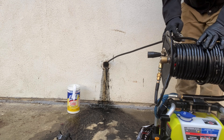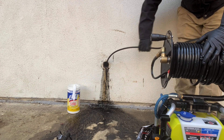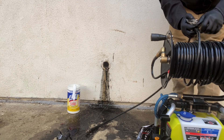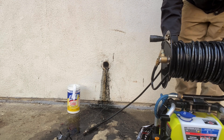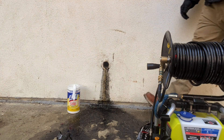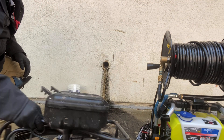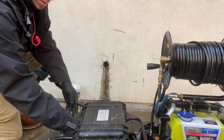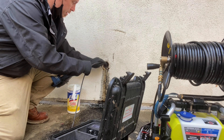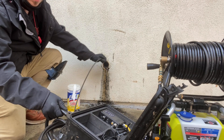You can use it to unclog lines — any two inch, inch and a half lines you can unclog with this setup. I would recommend a quarter inch hose with a reel instead of the three-eighths I've got here, like a Piranha hose or something like that. This is the Amazon special, but even with this you could unclog many two inch and inch and a half drain lines. If that's all you want to do — if you don't want to get into cleaning at all — this thing would be pretty much all you need for two inch and inch and a half. I'd even say possibly three inch, because it chopped up the wipes really good.